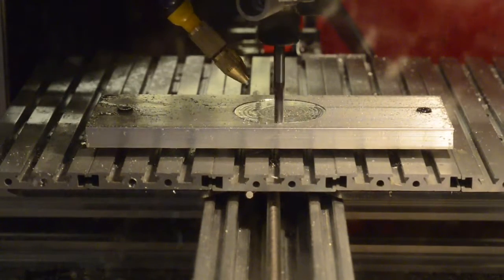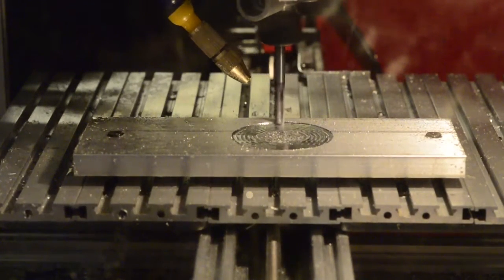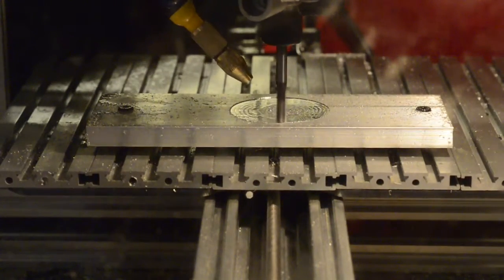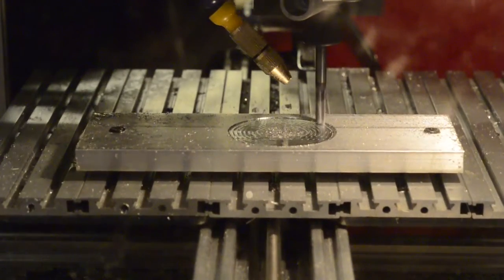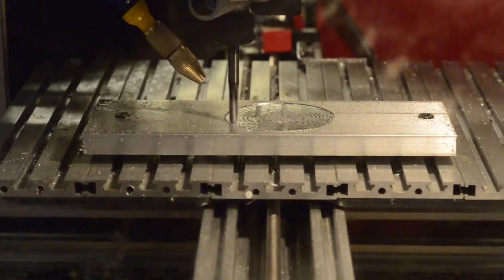The plate below that is a quarter inch steel plate which was plasma cut. The main reason why I went with steel is I was trying to avoid deflection when the machine was plunging in. The steel provides a nice rigid platform that does not give or flex or anything of that sort.